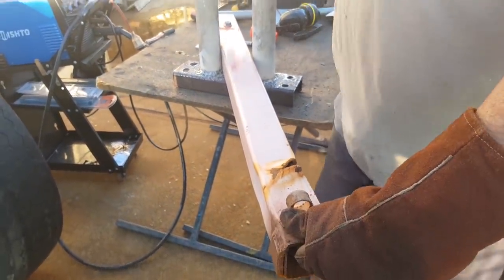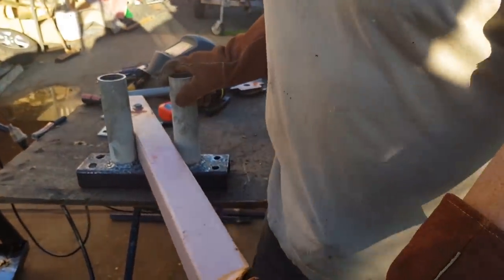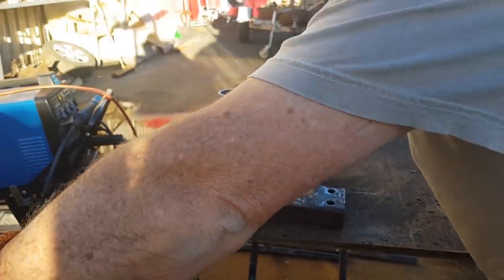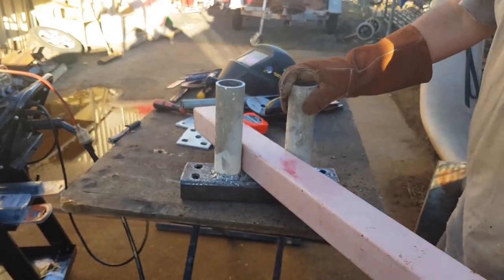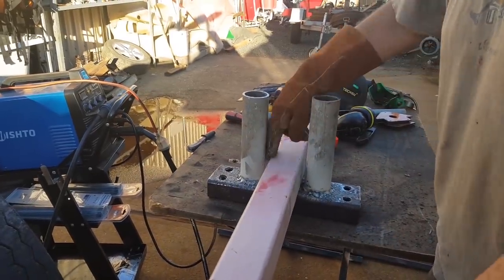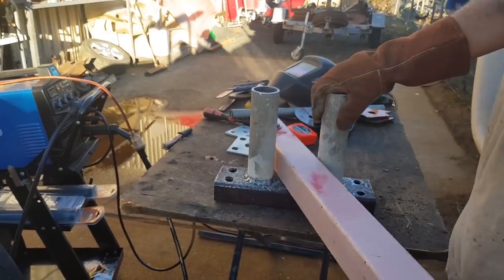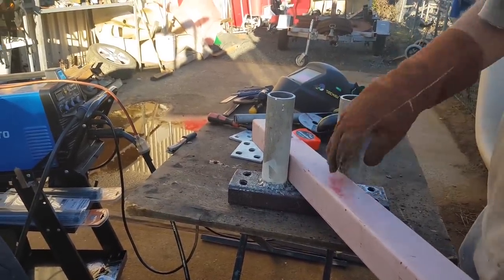So we've got the pivot point here. This is going to fit on the chain drive. Look at that. Pretty good, eh? That's sliding well. Yeah, I think we've got the distance right, and we worked out if we pack it here with some circular shims, we can increase the steering even more without breaking anything. So that gives me 45 degrees of turn. It won't quite jackknife.